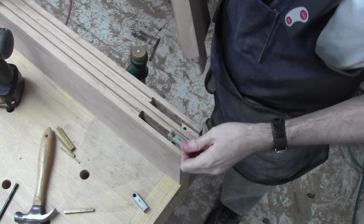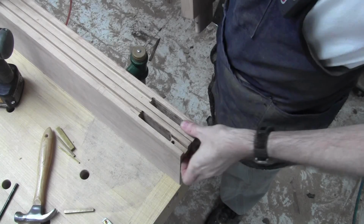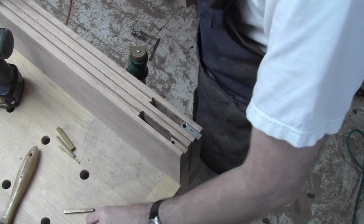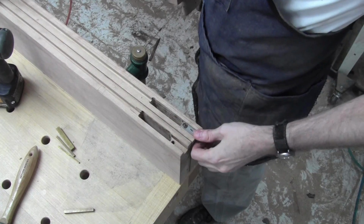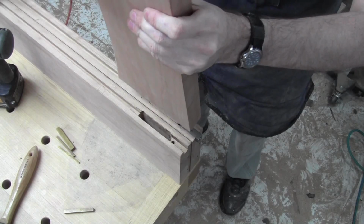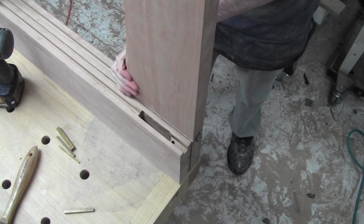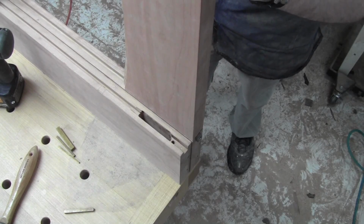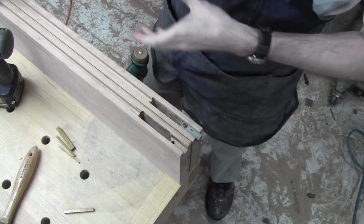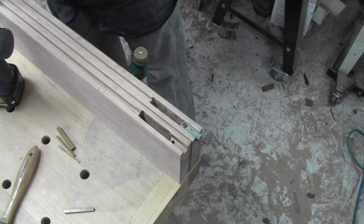I'm going to do the same thing to the other side. Put this pin in. This pin goes here. Tap that down in there. And then the dowel center can go in. It's a little bit high. It's fine though. And then we take our 2 line here and get it pretty close and tap it down on it. Same thing. That drives it home enough. We've got our little point. That's where I want to drill. Okay, so now I'll get set up to do that.